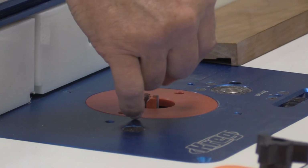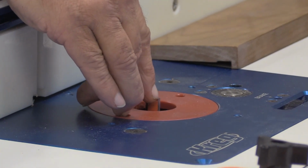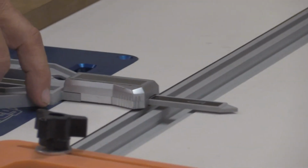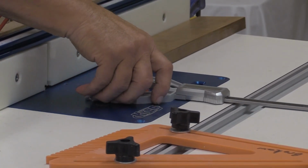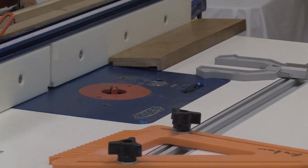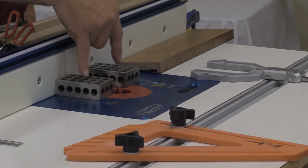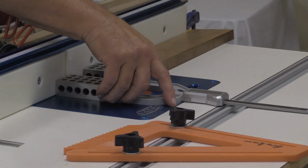So what you need to do is be able to adjust the fence 3 1/4 inches back from the front edge of that cutter. Kind of my favorite tool for doing that is one of these horseshoe depth gauges. The downside of that is at full extension, you haven't got quite enough gauge. Better go buy another one. Must be. So what I did instead is I looked through some of my machinist toys, and I came up with 1, 2, 3 blocks, which these days are pretty inexpensive.